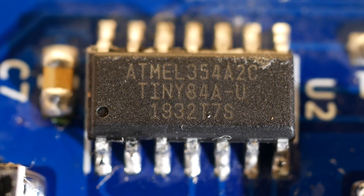I chose the ATtiny84. It's not the latest or greatest, but it's super easy to program with the Arduino environment, and a lot of makers have used this processor. That makes it easier to troubleshoot by looking up common problems online, such as getting sleep mode to actually work. This choice does have one glaring downside though — the ATtiny84 only has four PWM pins, and I really needed six.